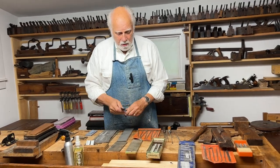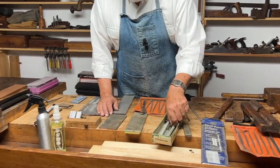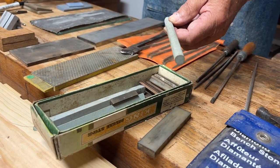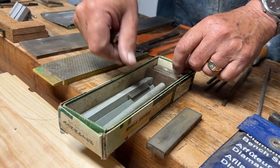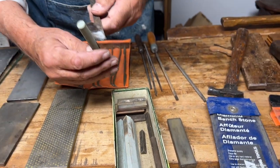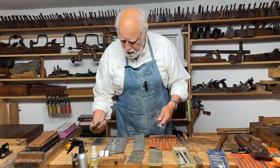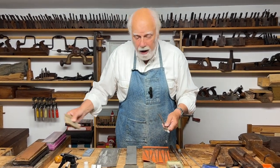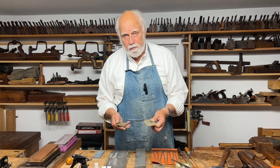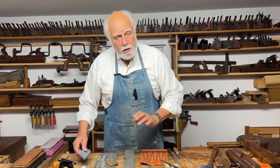Besides metal files, I want to point out something else: there are available a huge selection of shaped stones. Up to now, we've only talked about flat, big sharpening stones. But over here you can see I have a really nice collection of different shaped stones, and the trick is to find one that's closest to the shape you want and use it to sharpen that. These little stones also come in a variety of hardnesses — here is a nice white Arkansas stone, here is something a little coarser — and you just work your way up.